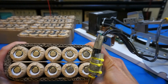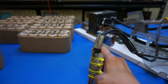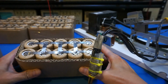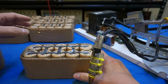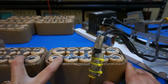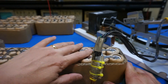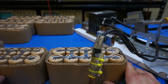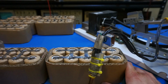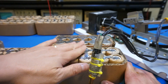So that is what I have so far. And by the way, so far I have welded all the other battery packs. As you can see, here is the weld. So the plan is, after I have them all welded, I'm going to take two of these, either using wires to solder these two together to form a 3.2 volts and 20 batteries configuration, or I'm going to tab weld these two to make it a parallel, and then I'm going to alternate the configuration so that I can connect adjacent cells together.